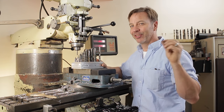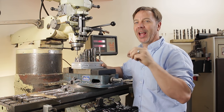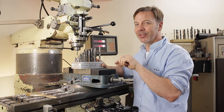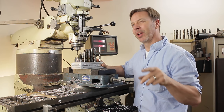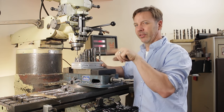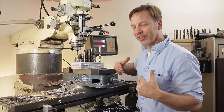Also remember when you're numbering these that the first one is always odd. And I don't mean odd as in strange, I mean it's an odd number, because if it was an even number, that means it would be a different fraction. So it makes it easier stamping these, because you can take out the 4, the 6, the 8, the 2, because you don't need, well, you do need the 2, because you do have 23/64ths, but besides that, you get the concept. It makes it a little bit simpler for you.